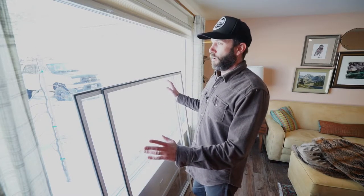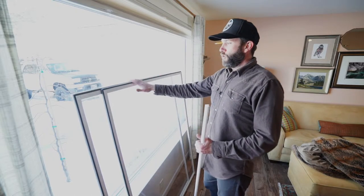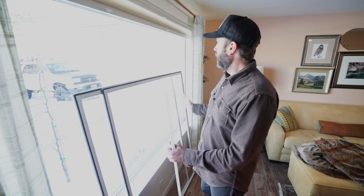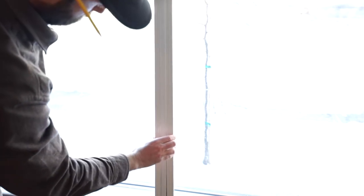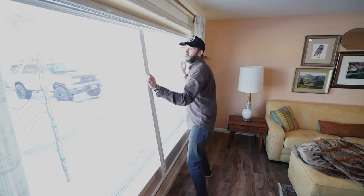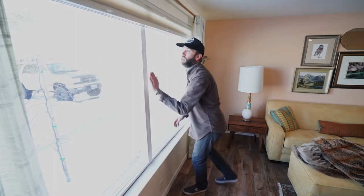Here we are back out front. This is a big window, and one insert for this would be huge. There's an upper limit to how big they can make these and how big they can ship. So what they do is break them into two separate panels. They take two inserts of the same size and this little piece of plastic H-track. The H-track goes right in between them and holds them tight, then you basically shove it up into the window just like any other insert. You jam the H-track on one end of one insert, butt the other insert right up next to it, and slide it back up behind as one big unit. It's big so it's a little awkward, but it's not that bad. And in it goes.